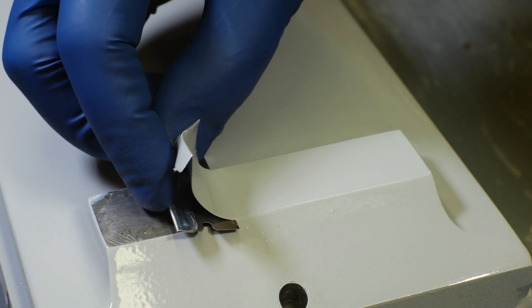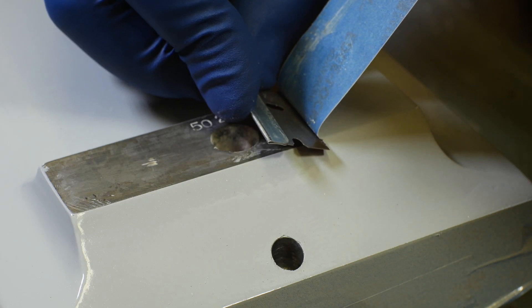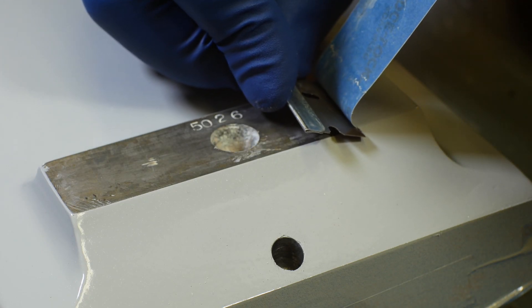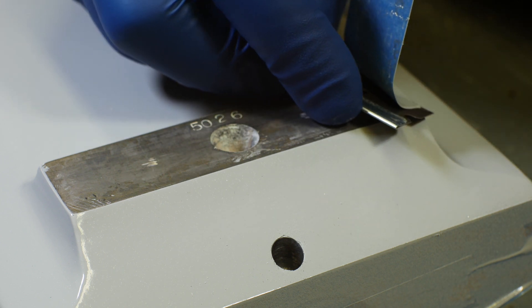When the paint had finished drying I removed all the tape and cleaned up any paint that had snuck underneath, stoned all the exposed metal surfaces, chased all the threaded holes, and cleaned out any of the bore holes.